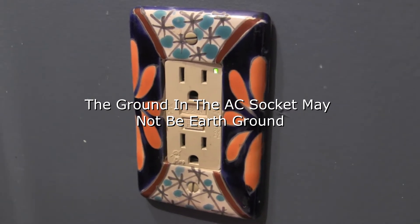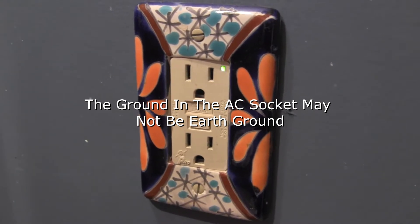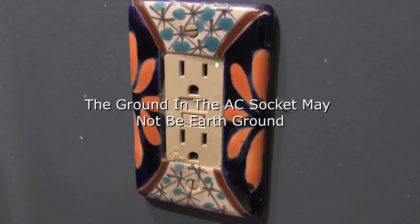Following that theory, connecting to the ground in the AC plug is not necessarily earth ground - it may be AC ground, it may be electrical ground. Even if you plug in a tester and it shows a connection to ground, the AC wiring has to be done properly, which is not true for a large proportion of AC connections in homes. Before it got to earth ground, you'd actually be picking up a lot of AC line noise, so the AC ground in many instances could not be considered a really good earth ground.